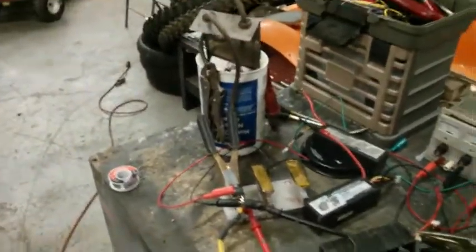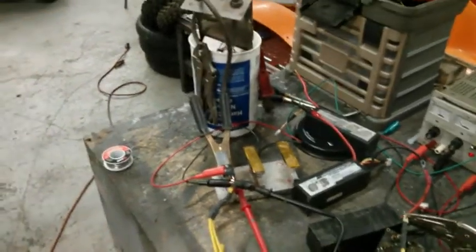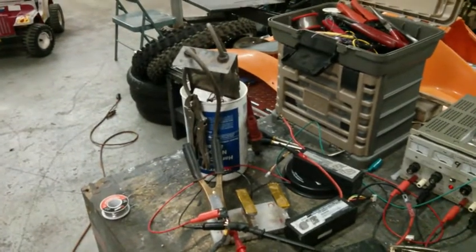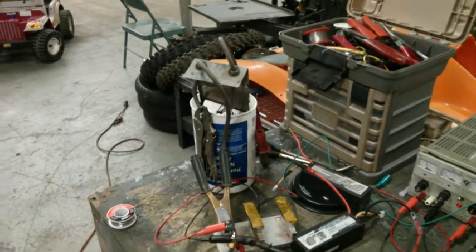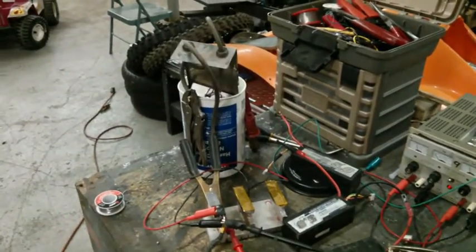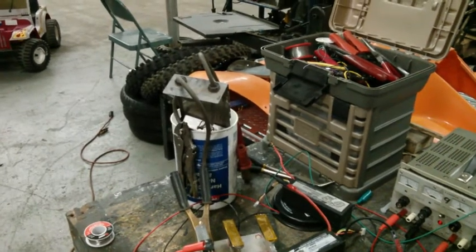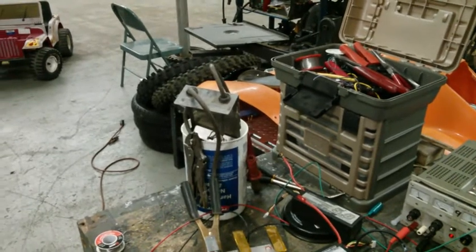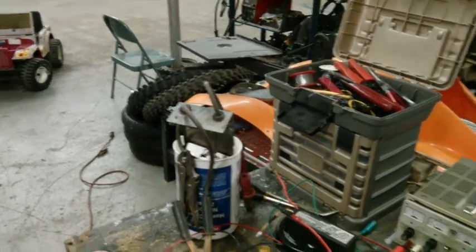Definitely a handy thing to have, especially for what I'm trying to accomplish here, which is to verify some datasheet claims, that these will actually flow the amps they're rated for. But when you're using them in a 3-phase motor controller, you have to understand that even though you might think you can hit some really high amperage with them, what actually happens is you're hitting peaks on phase amps, and that doesn't equate to the same amount by any means of battery DC amps. So usually your DC amps are a long ways below what your peaks on your phase amps are.